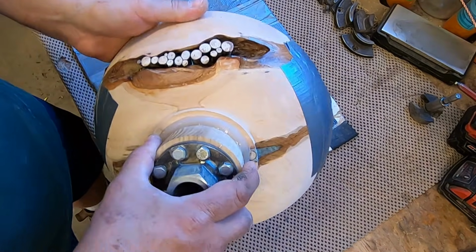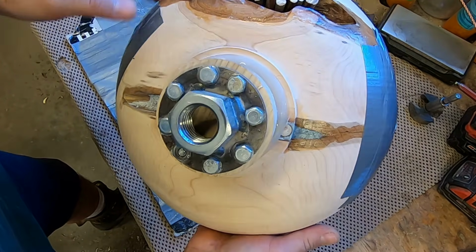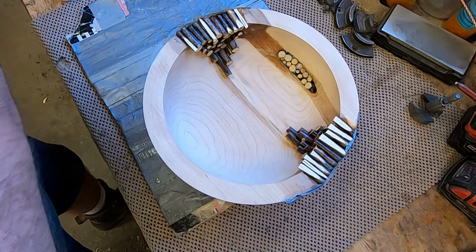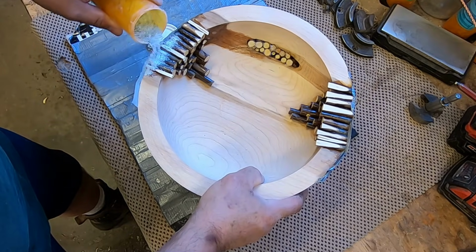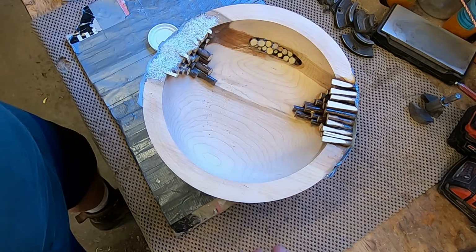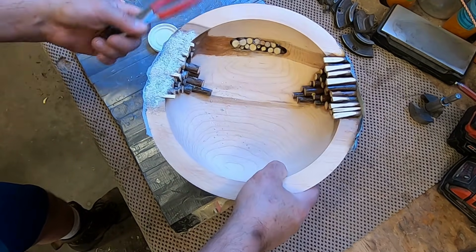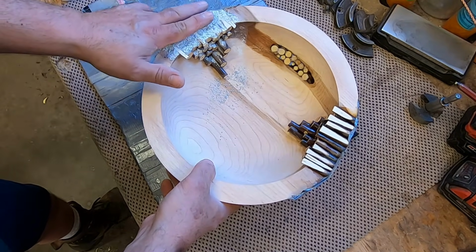Okay, so we're over here at the inlay table. I'm gonna leave this and this just straight soapstone, and that will mimic what's going on here on each side of this, so that'll be good. And of course we're just going to take the soapstone that's been all crushed up. Now I like to work at the top, and what this will act as is a dam. So up there, and then just kind of wrap on the bowl, try and knock the material down into all the voids.